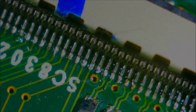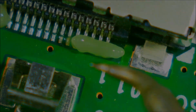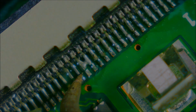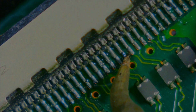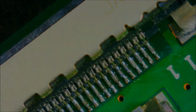And even the small connectors by the connector sometimes may have a little solder bridge, so we need to check that one too. So I'm going to change the soldering iron tip to a small one, that gives it better control. Still making some solder bridge, but we're going to take care of that. These small tips come very handy.